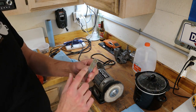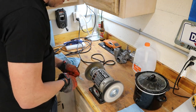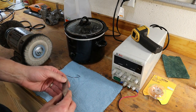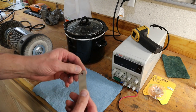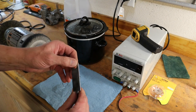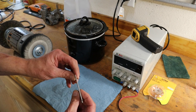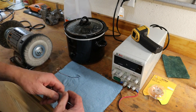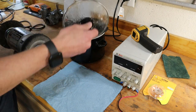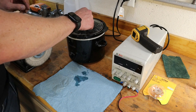You can already tell it's rusting really quick, but that's okay — once we hit it with the bench grinder, that'll all be removed. Now that we have our part really shiny: if you wanted a dull result you wouldn't have to bench grind, you could just acid bath and then go to the next step. But I like the shiny look, and making sure your prep is on point is going to make the end result that much better. Now we put it back on our line and drop it into the crock pot degreaser — we're going to let it sit for about five minutes.